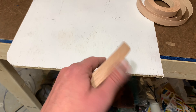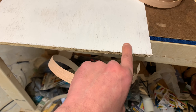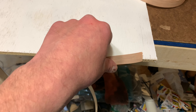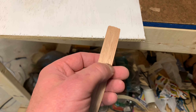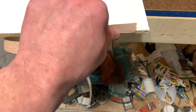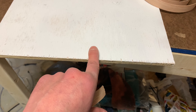The paint is all dry. Let's go ahead and start edge banding. We're only edge banding three of the sides because we're going to use this as our barrier for when we put the resin in. We're going to leave about half of this lip left over, and we're hoping that should be good enough to hold the resin in — we might need to add some glue on the inside.